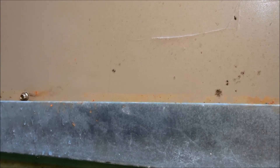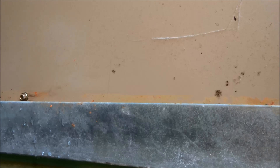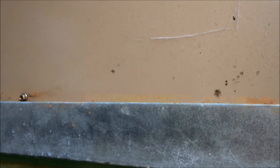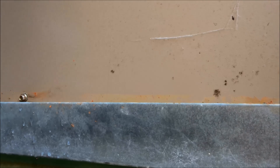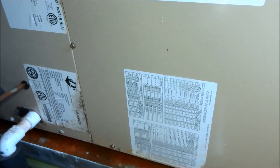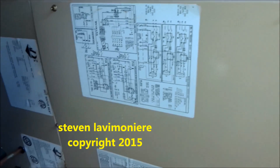It seems to be okay. No blockage in the line going out — I don't see anything at this point. I ran water down the pan on the inside and it seems to be taking it. Nothing's backing up here. I'm doing a little video and you guys make up your own minds — I'm not guaranteeing nothing. Would you say that you did not see mold? You're gonna see in the video I didn't see any. I'm doing a little video for you and you guys can see what I see. I dumped a couple of gallons down there and it all went down the drain. It was holding water in the pan — if that pan was cracked it wouldn't be holding water. We blew this line out going outside. I think that's what the problem was — the blockage. I didn't see any visible mold. I cleaned the coil.